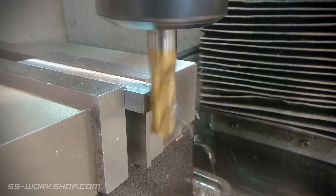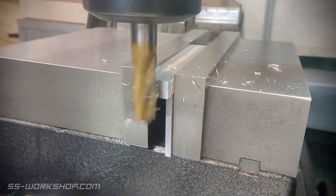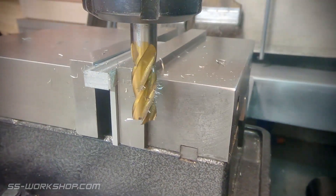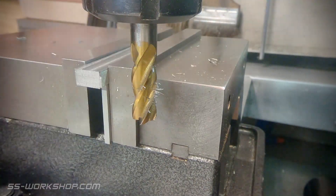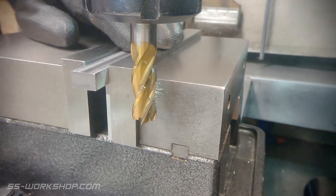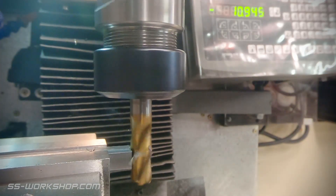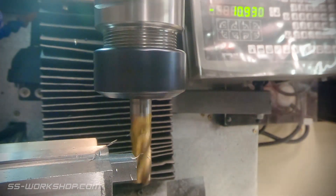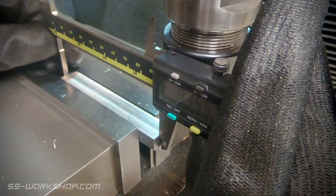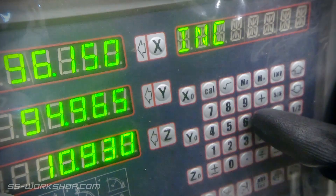For today's part I'm starting with a pre-machined piece of offcut. It's 9mm by 15mm, with 9mm being the finished width, so we're going to save a bit of time with that. First task is to machine this to correct length, so I square one end, flip the block over and do the other end. Once it's squared both ends I measure the length, then set the digital readout, which will allow me to make the final cut.